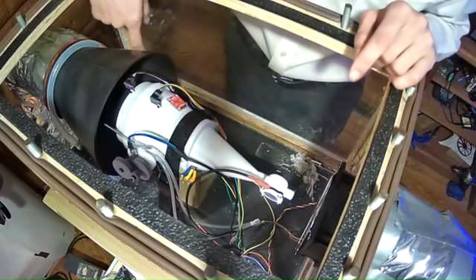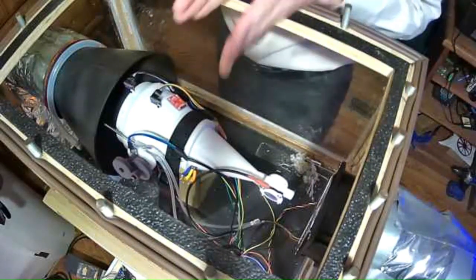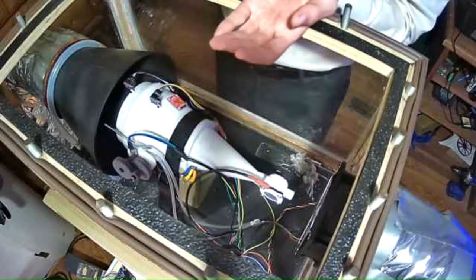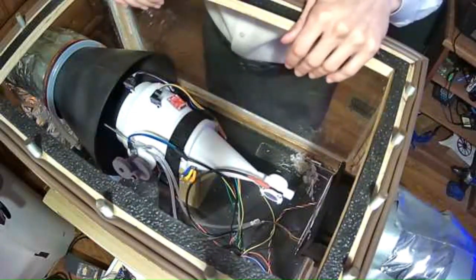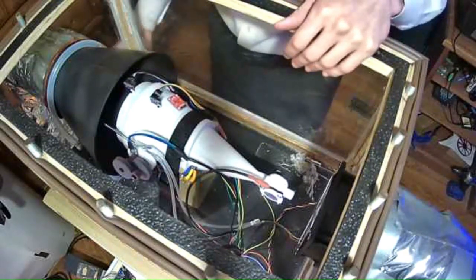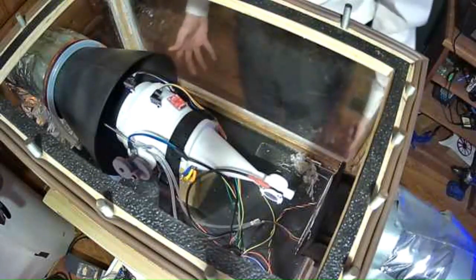And I have 2 computer radiators. These are 80 by 80 millimeter on a liquid cooled system. So it has an aluminum water block, one on each side of the Peltier modules, and I have 5 40 by 40 millimeter Peltier modules. And so they're 15 amps, 12 volts each. I have over a kilowatt of heating capacity effectively on here. And I have behind here a much bigger computer radiator to dissipate the heat.